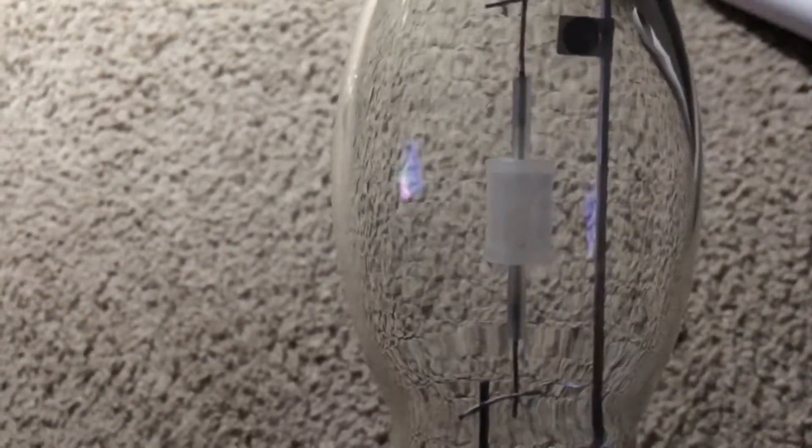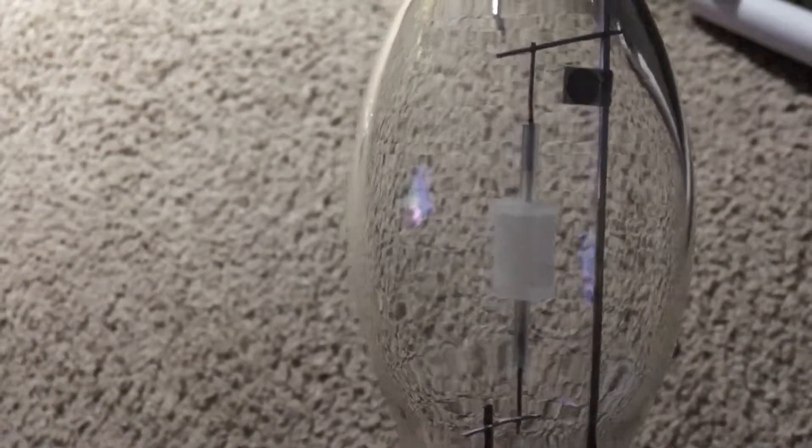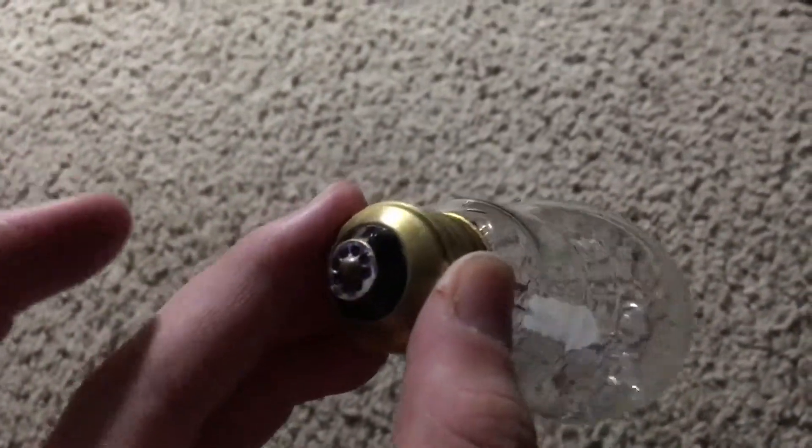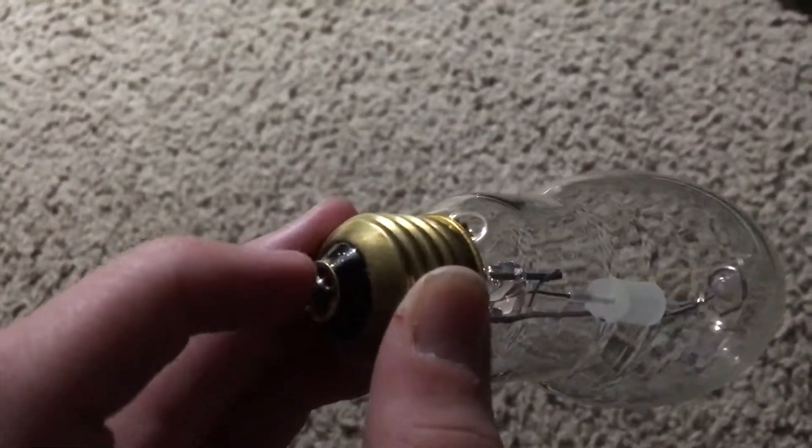Here's the arc tube itself. Those two little things that are poking out into the arc tube are the electrodes, which operate at high temperatures so they can produce the light when the light operates. It operates at 50 psi, even though this arc tube is made of ceramic, not quartz. We also have a very nice brass base as well, along with a glass insulator too.